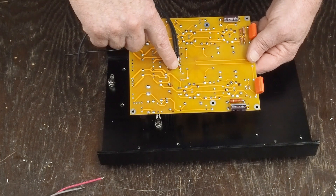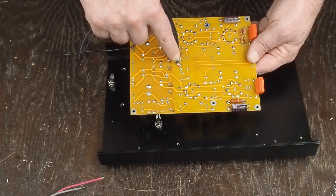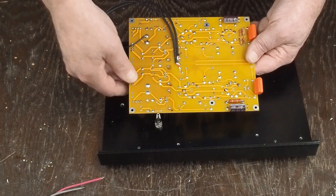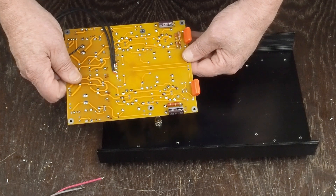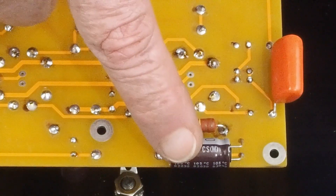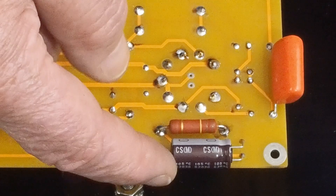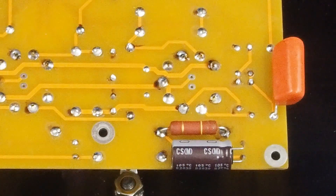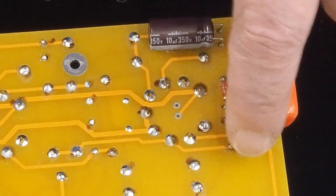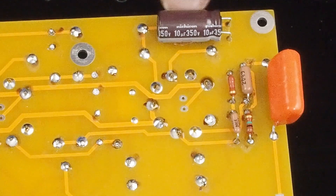On the underside of the board I've got the output shielded cables going to the RCA jacks soldered in at the bottom. I'll use contact cement for strain relief to attach them. I put a resistor, a capacitor, and a coupling cap all on the underside, with a little contact cement to keep the capacitor from dangling. On the other side I put all four resistors, the coupling cap, and another capacitor, again with contact cement holding it to the board.